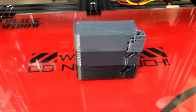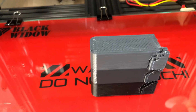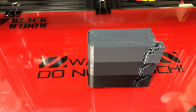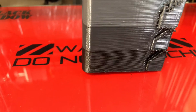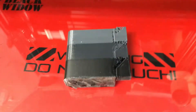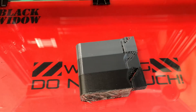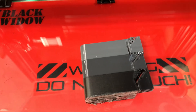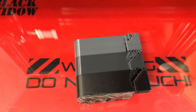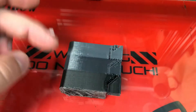Overall conclusion — do I recommend any of these products? If Atomic would fix the red, I definitely love that color so I'd recommend it. Overture and Matterhackers are great filaments if you're looking for a gloss black. The 3DX Tech at the bottom is really, really nice matte. But keep in mind you're going to pay a premium since it's a pro series — though honestly it gives you about the same quality as Matterhackers and Overture. For what I'm doing I just need an object to fit within maybe five to ten thousandths of an inch.